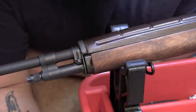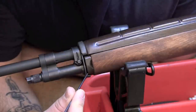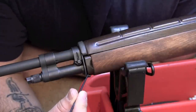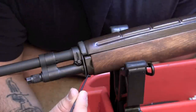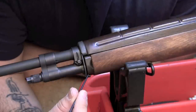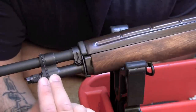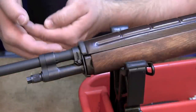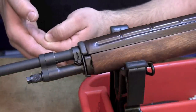This is where we're really going to start getting into some more meat and potatoes of accuracy. This mating surface right here is basically the bread and butter of M14 accuracy. If you want a rifle that shoots really consistent, we have to have what's called draw pressure. The barrel should be pulling up on the stock — you should have two opposing forces pulling against each other.